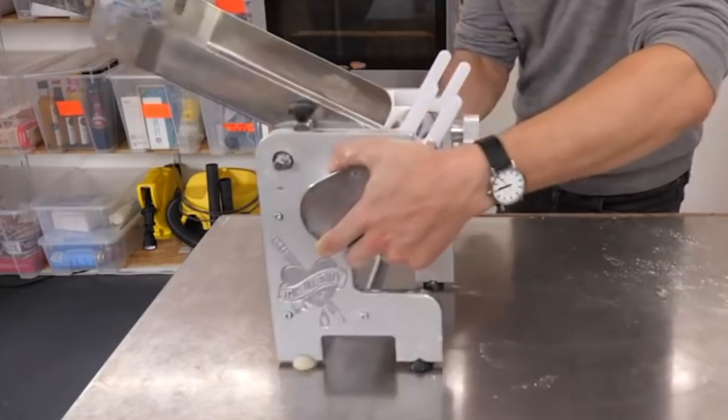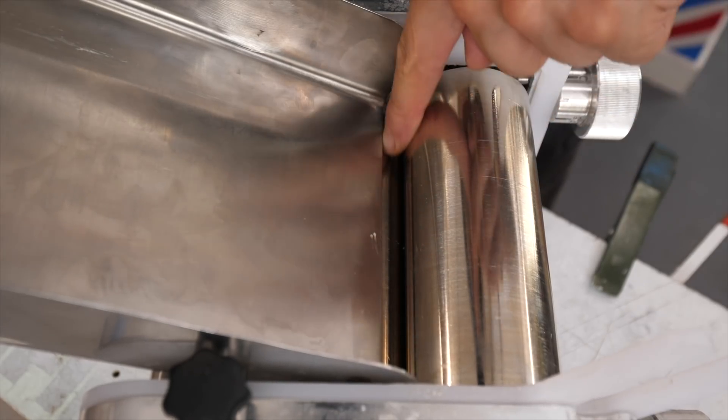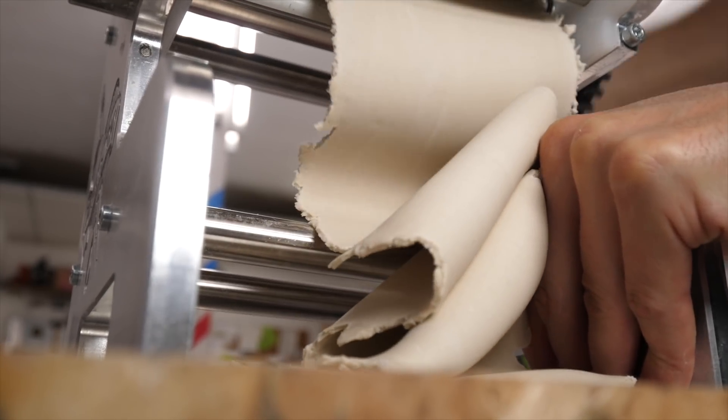So basically, this version five is gonna address two problems and add three new features. Problem number one: stability. Whenever I crank up the speed, the machine is just all over the place. I can't use rubber feet, nor can I use suckers, just because of the flour situation — nothing sticks to the table. Problem number two: as the dough leaves the feeder to enter those flattening rollers, there is a little gap, which turns out to be a very big problem because it's ripping the dough apart. So I need to address that as well.